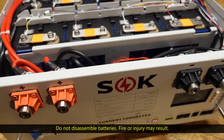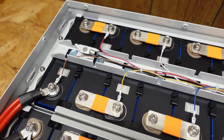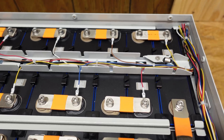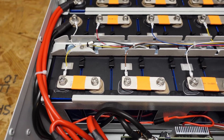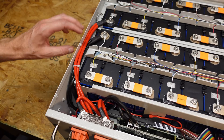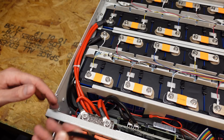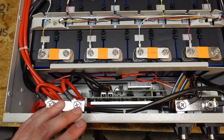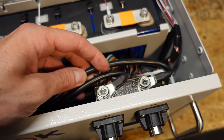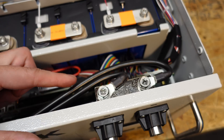The bottom of this steel lid has an epoxy board insulator. Here's our first look at the inside of this battery. One big thing this company advertises is the ability to repair and disassemble the battery — the cells are all bolted together with no laser welding and should all be easily removable. Looking at the main positive and negative cabling, these wires do not have any ratings printed on them, but they do look like seven gauge wire. One thing I noticed is this wire is bent at quite a sharp bend — it looks like the lug rotated as they were tightening it down.